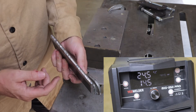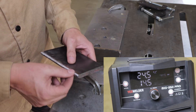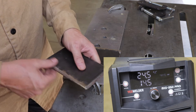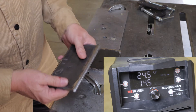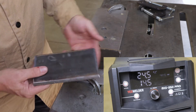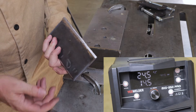All I need to do is hold this plate together. I don't really need full penetration, but I cut a v-groove in there because I'm going to fill that with weld and then grind it smooth on the outside, so hopefully I have plenty of weld still in there to hold the two pieces together solid enough for a base. This is just an experiment, but I thought I'd film it and show you guys how the machine does.